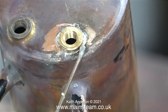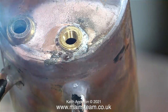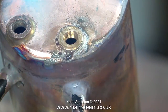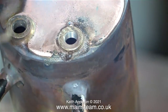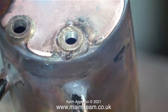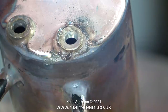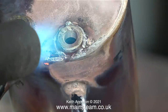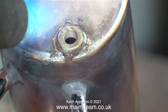In this video there are many places to fit innuendo and the odd girlfriend joke. All I would like to say is, as a male of 68 years of age, I've had plenty of experience, and I do know that the first thing you must not do is go straight for the bush. It's only when all of the water has evaporated that it's a good idea to apply the blow torch directly to the boiler bush. What I generally do in these videos, just to show when the temperature is correct, is apply silver solder prematurely. At the moment there is insufficient heat — it's melting the silver solder, but it takes a while longer before the silver solder flashes around the joint.